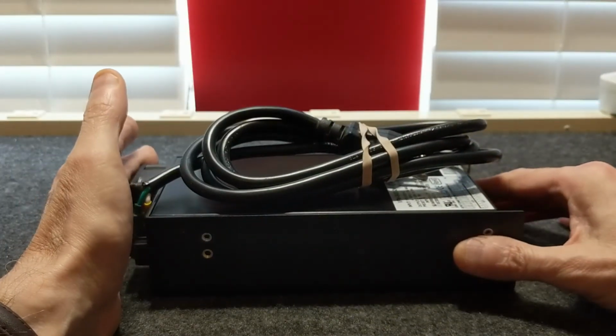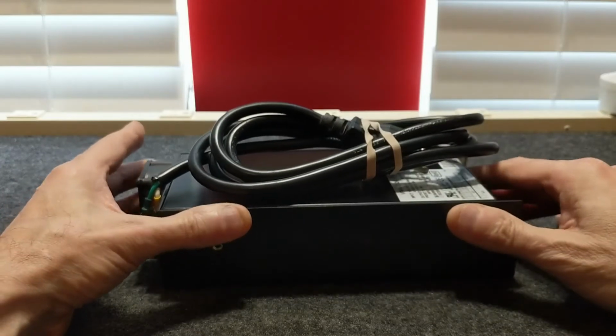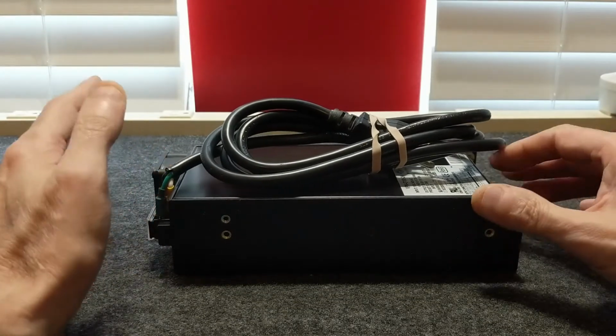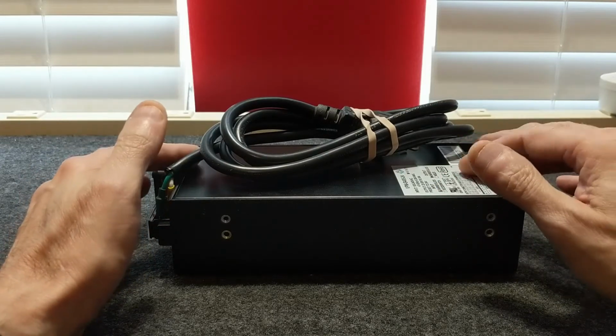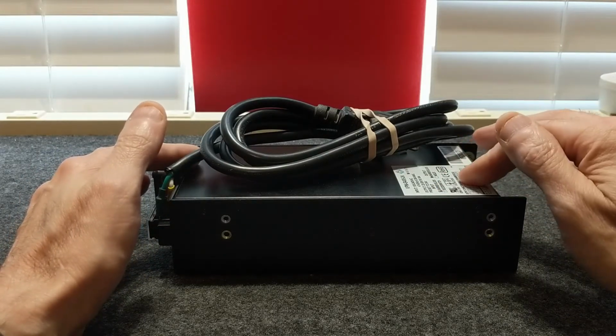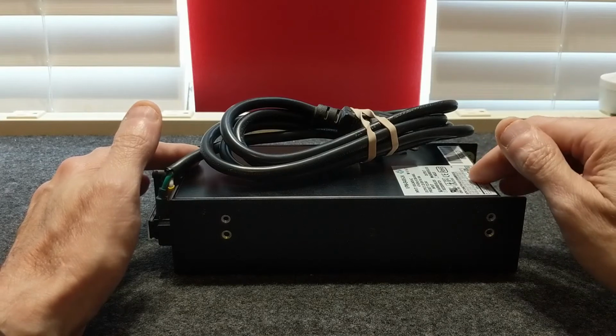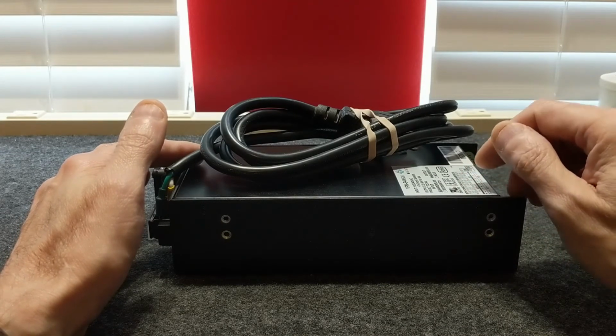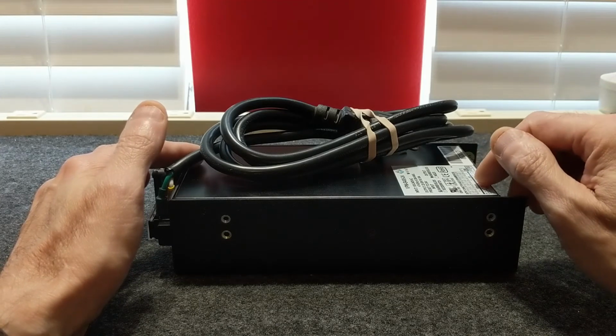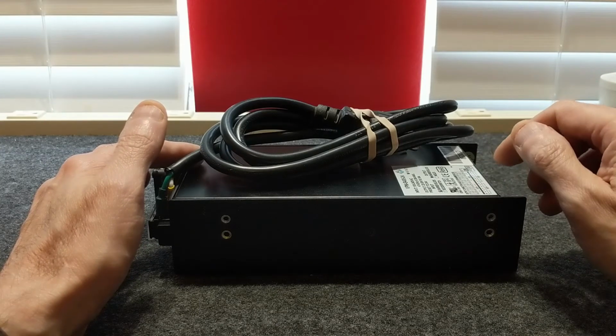A very nice adjustable power supply capable of up to 540 watts of power. The DC booster allowed me to increase the voltage to 60 volts at 6 amps for 360 watts of usable power. Plus, it also gave me an additional 60 watts to spare in the future should I need it.